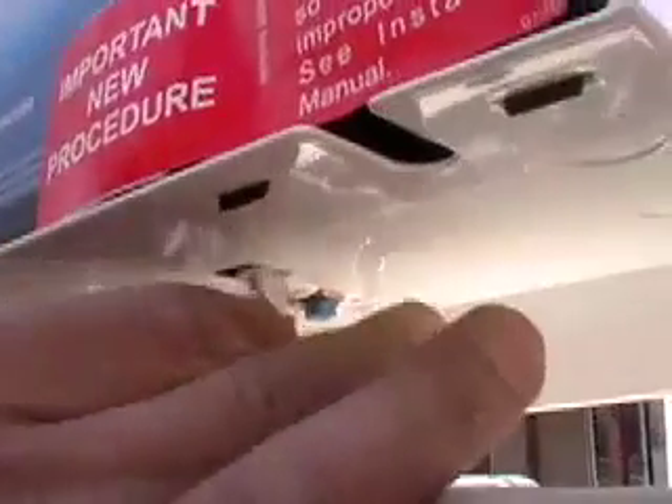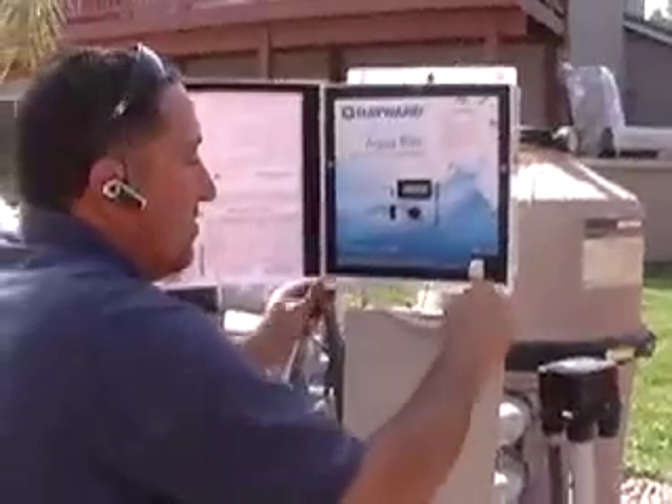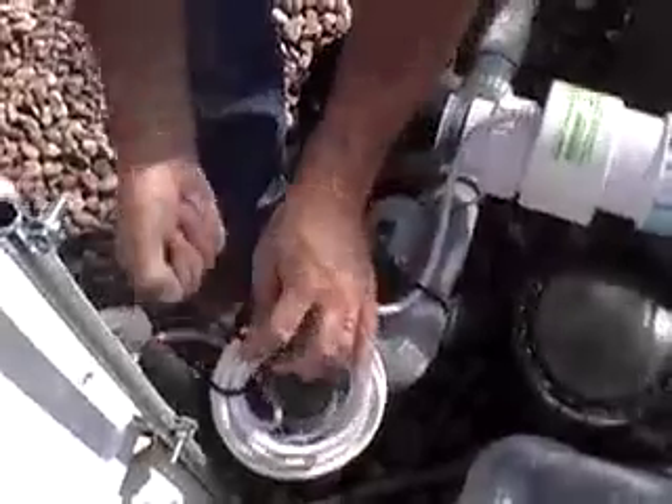After completing the wiring, close up the panels. Route the wiring from your turbo cell and your flow switch along the plumbing. Locate the hole in the bottom of the panel that looks similar to a phone jack and plug in the flow switch at this point. Plug the turbo cell in at the bottom front portion of the panel. Push it in firmly to make sure it's in all the way. Complete your installation by securing any excess wiring off to the plumbing and adjacent conduit with zip ties.